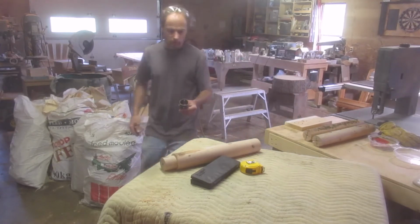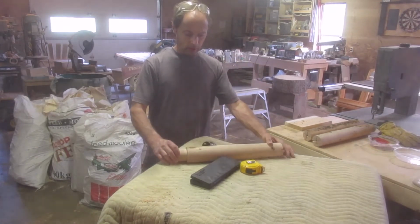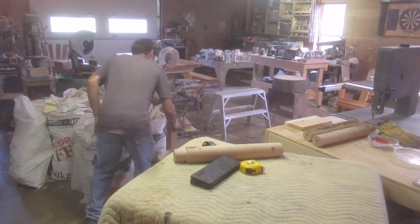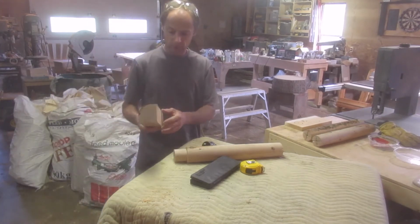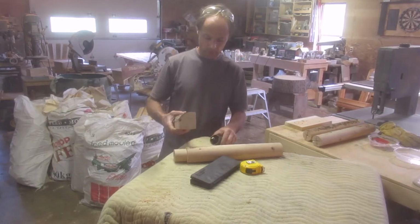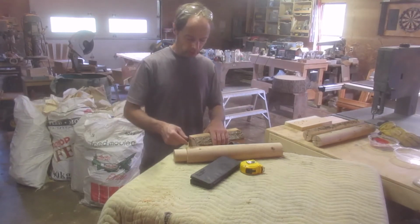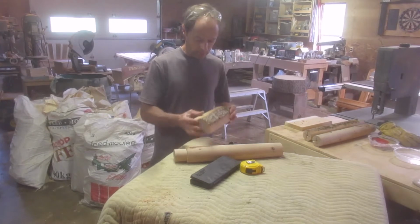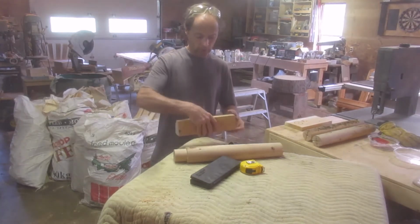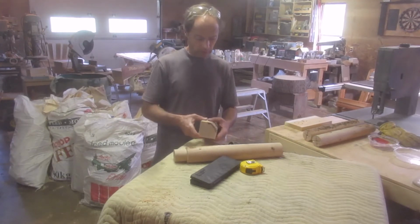Now what I have to do is, since I want to put the legs in at an angle, I got to make myself a guide. I can use this, I suppose. Put this through the jointer, make sure it's squared, and then pilot drill a hole at the angle I wish, and then all I have to do is line up the surface with the lines. There's 3 lines, right, going to the center of gravity of the table, and this is going to be at an angle.